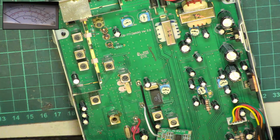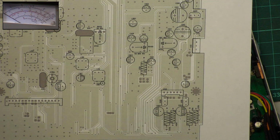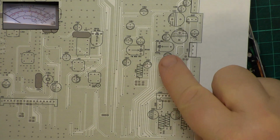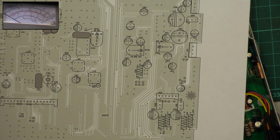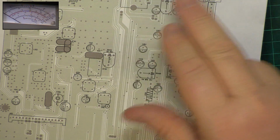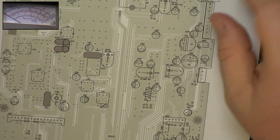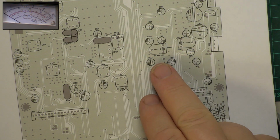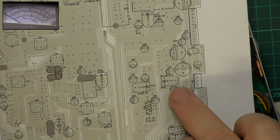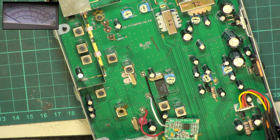So there is. I've got a copy of the instruction book, and I've managed to print off this, and it does say here what the controls do, which saves me faffing about. And it says APC, so that'll be automatic power control. And we've got TX S meter, which sounds like it's a real one, because most of the time it's a glorified transmit light. Receive, squelch, AM modulation. We don't need to touch that because we're not going to be using it in that mode on EU, but at least you know it is there. FM mod, which is deviation, and the power control. So we'll go for that one, and hopefully we will get more than what we've got at the moment, which is about 3.2 watts.